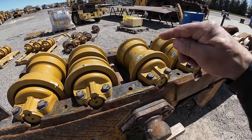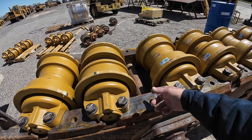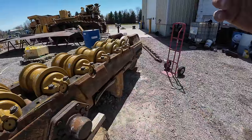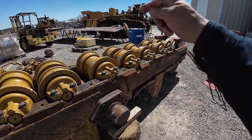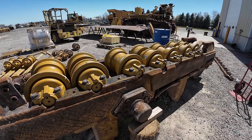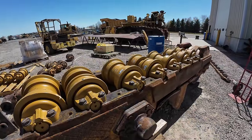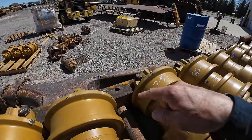Anyway, I'm just going to try to take the tap and go down the bad holes and see if it'll tap out at the size it is. See if the bolt goes in there and make sure I can get a 41mm socket down through the guard where it sits. That's how I'm going to fix that. If that doesn't work, then we're either going to weld them up or put those keenserts in.